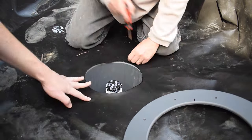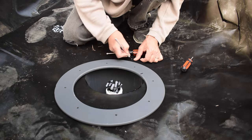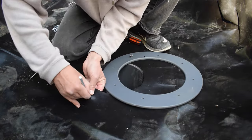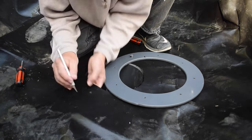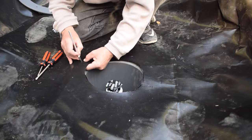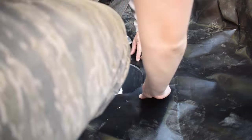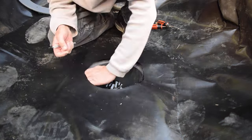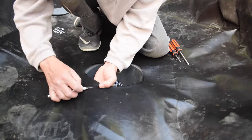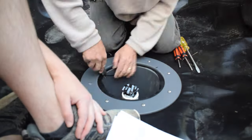The next step was to make the holes for the screws. It's important that the liner is not shifting as you make your holes because then your holes won't line up correctly. The instructions say to cut an approximate quarter-inch hole for each screw, which is slightly larger than the bolt diameter — I'm assuming to ensure no pieces of liner end up in the screw holes. My dad used screwdrivers to make the holes and then an exacto knife to cut them out properly. We then test fit the top flange, my dad cut away some excess liner, and it all fit perfectly.